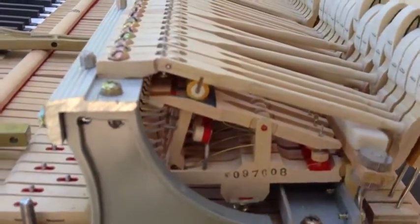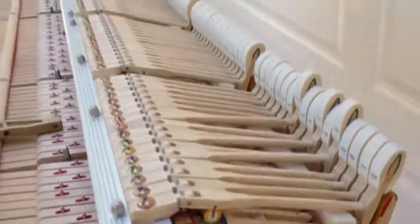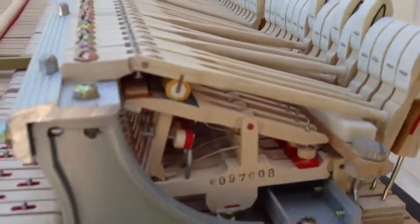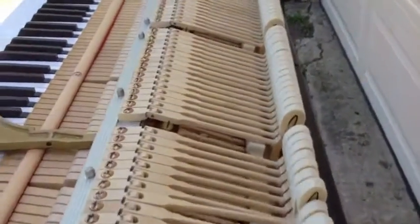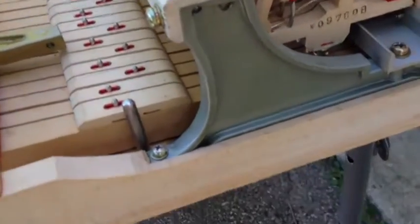Tightening this rail screw will allow me to adjust the spread. I'll be measuring from this flange pin to that flange pin down there to get my spread. According to my technical sheet, the spec is going to be 112.5mm, though there are two different specs, so that's just the starting point.